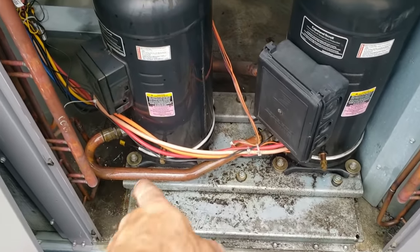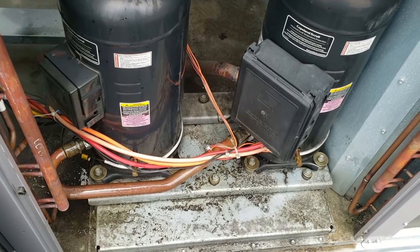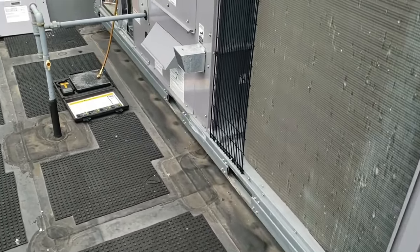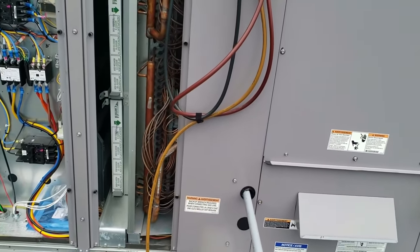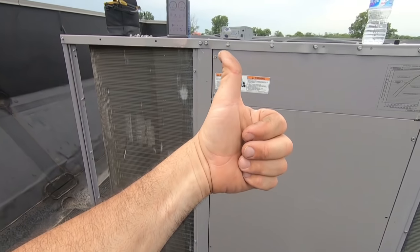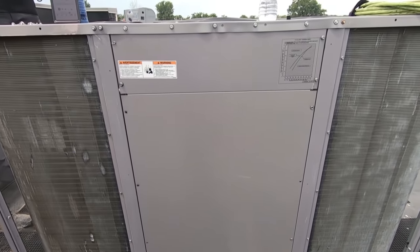Yep, there she is, plain as day. We'll need to come back — we're going to order a new rotolock and new seals for both of them, chop it out and put a new one in. We'll pull the refrigerant out and weigh in the factory charge — that's going to be the best thing. I scanned the rest of the system and did not find any other leaks. Checked the evaporator really good, scanned all up inside the distributor tubes — everything was good to go. If you like the video and want to see more, give it a thumbs up, like, share and subscribe.